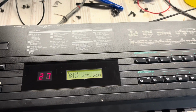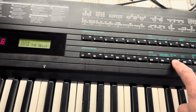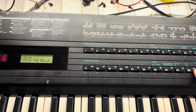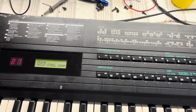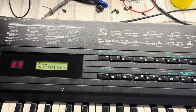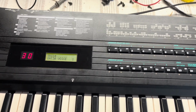So then back together, switched on, and this is why you don't put all the screws in. So look at this, 26, 27, 28, still not working on 28, okay, and that's with a new switch in there, so it must be the diode that one uses is probably gone as well, or there's a dry track somewhere. So yep, got to pull it all out again.